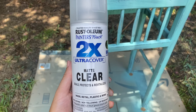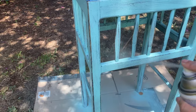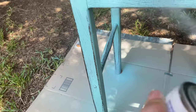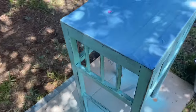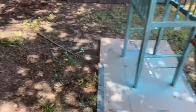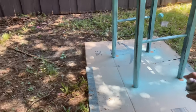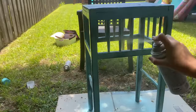Okay guys, and since I'm incredibly impatient, I went ahead and sprayed the table with my clear matte sealer — like a polyurethane kind of spray paint — and went ahead and did that so that I would be completely done. I taped the top off with the painter's tape, spray painted it, immediately got my sandpaper and sanded it wet, and then immediately did a second coat with that clear matte finish to seal it all. I mainly did this because I sanded it and I don't really know how old the table is or the black paint that was on it. You always have a risk of having lead in it, and that's why I wore a mask when I was sanding.